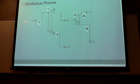Now you have your ethanol sludge going into your first distillation column. From here, your bottom product will be 99% basically pure water. The top will be about 88% ethanol. It then goes into a sieve, which uses a benzene catalyst, where you will eventually get your 99% or 100% pure ethanol product.